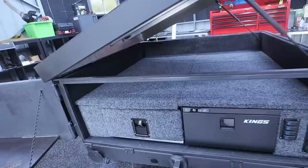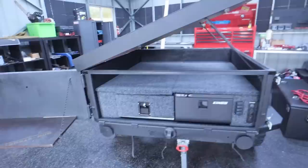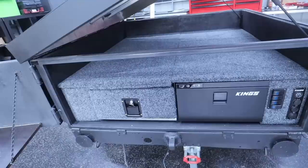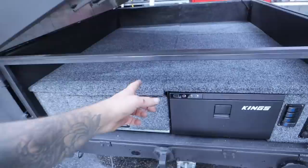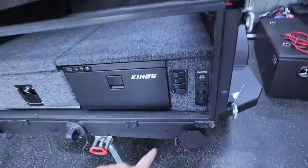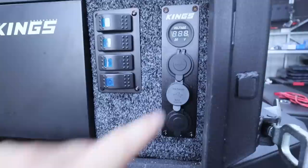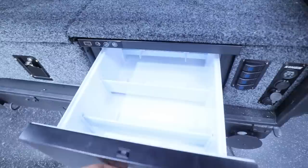As you can see, it looks nice and neat now. None of the floor is actually screwed in at all — it's a very tight fit. You could probably just about leave it like that, but I'll screw it down. I did manage to mount the switch panel — just a couple of screws, nothing's wired in yet. For any of you blokes trying this at home in the back of your ute or in a canopy, if you are laying carpet and folding it right around the way I did, you do have to leave a 15mm space to allow for the thickness of the carpet on each end. I actually really like how it's not super complicated — it's going to be very simple, and we have multiple USB ports.